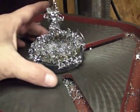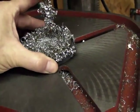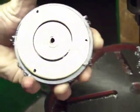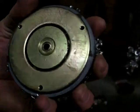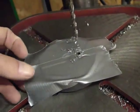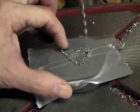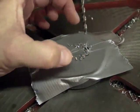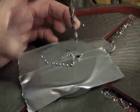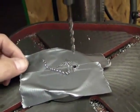Step one: we drilled a hole right through the back of that magnet — well, not actually through the magnet itself, but through the steel core in that thing. Don't need much of a clamp to hold it down, that's for sure. I drilled another hole using the center hole to bolt this thing down, because the diaphragm ring doesn't actually connect to the center — it has kind of a pocket back behind it. So I drilled a hole through the back of the magnet into that pocket so I can bleed oil into the backside of that diaphragm. I put duct tape on there so I can pull it away and more easily get the shavings away from the magnet.